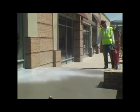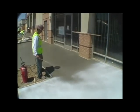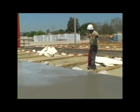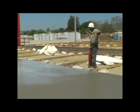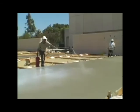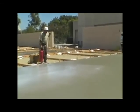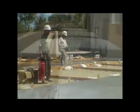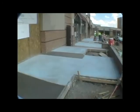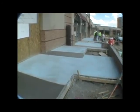The typical application rate for TopCast is 200 to 350 square feet per gallon. Make sure you estimate the sufficient quantity necessary to achieve the required full hiding coat for the surface area to be treated, similar to a full curing compound coat. Add an additional few gallons into your overall volume estimate as backup volume, just in case. TopCast is not solids sensitive — applications can be started and stopped without fear of over-applying or overlapping, as with other products on the market.